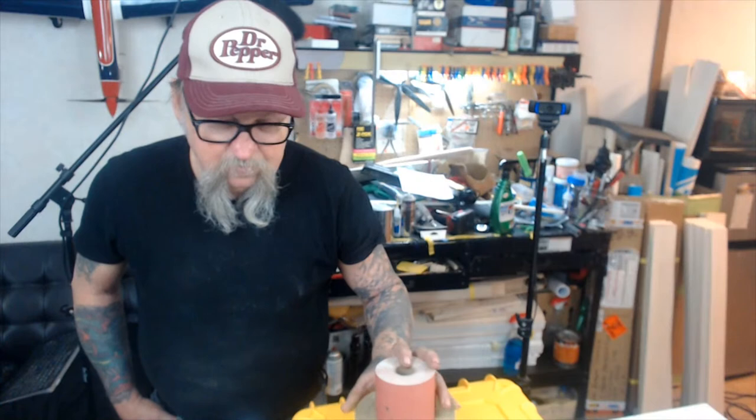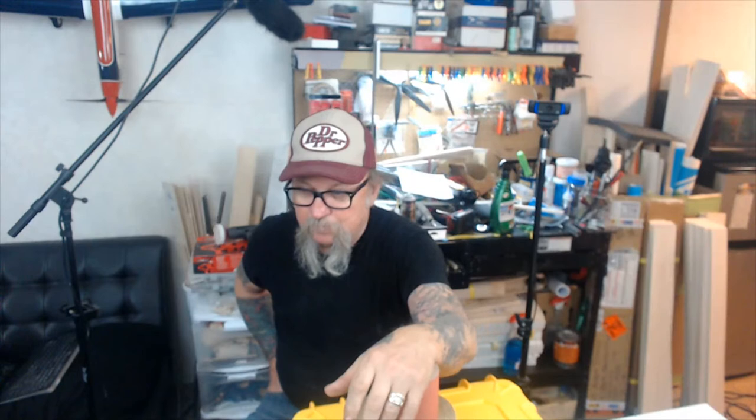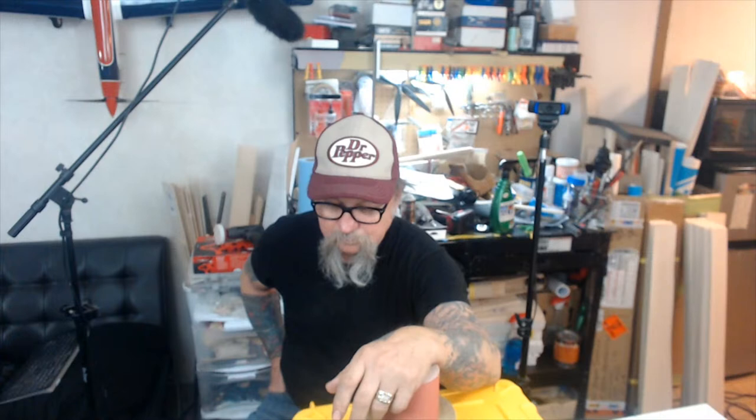And here recently, in the last couple of airplanes, I used to prime everything. You know, I used DC 540, but that went away. So we got the Crest primer, which is twice as heavy. I got a gallon of automotive primer that weighs, I'd say, 15 pounds for the gallon, and I was going to try to mix up my own primer with xylene and MEK and toluene, to thin it out and make that same formula as the DC-540.